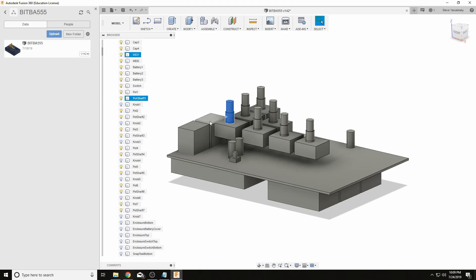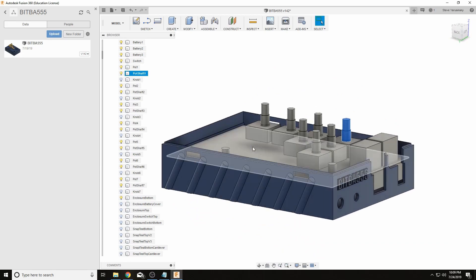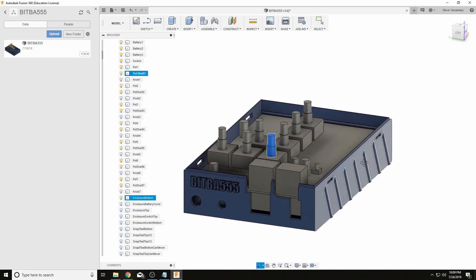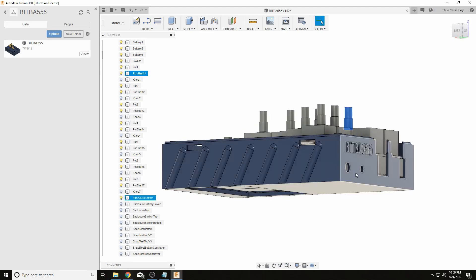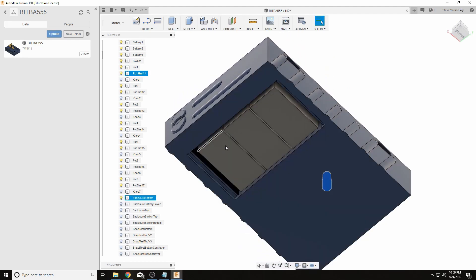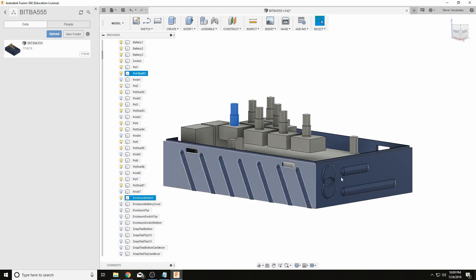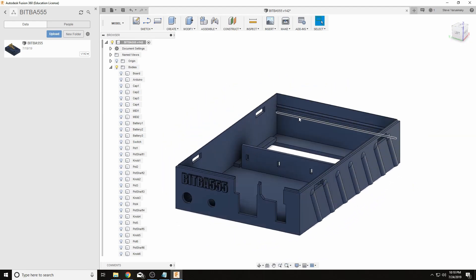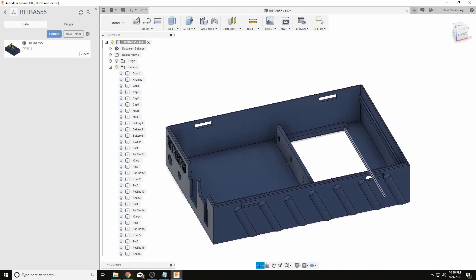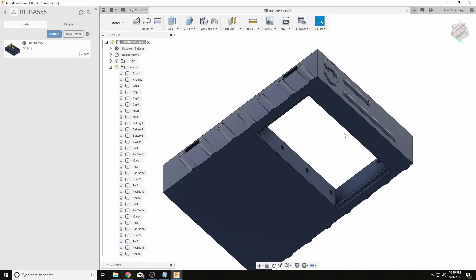In this case I started with the bottom of the enclosure. Basically what I was doing when creating the bottom was cutting out things I need: the power connectors, USB, MIDI connectors, the audio and power jacks, and the battery cover on the bottom. These slits here are because this enclosure is going to be snap fit, meaning it doesn't need any additional hardware. I also modeled in slots for the PCB so that it sits in there nicely and doesn't move when it's all put together, and a section for the batteries, plus an overhang for the battery cover which is also snap fit.